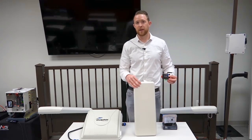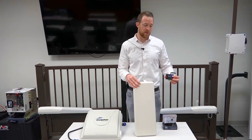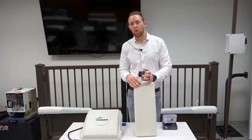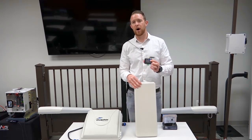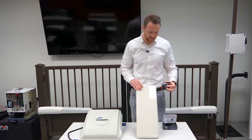And this system is going to get between 25 to 30 feet, can be minimized in the software to go down to 3 feet, but this is a great option and an inexpensive option when they don't have existing access control on the property, but want an RFID reader. They're able to monitor, track, set automatic open and close schedules, and restrict access. They can do all of that with this.